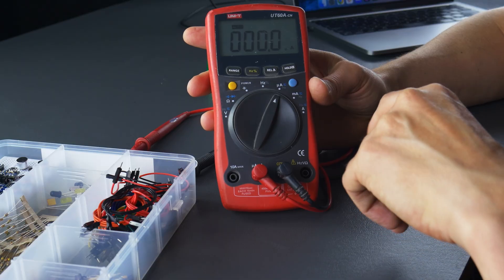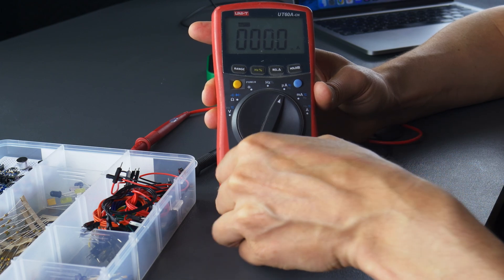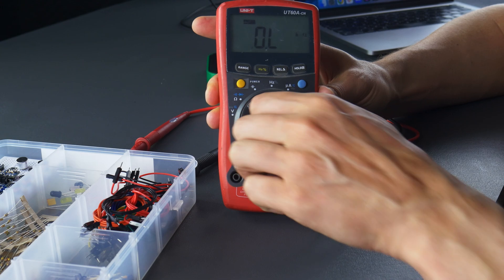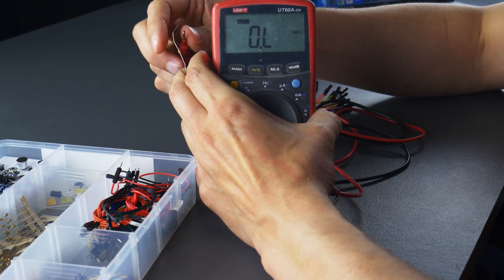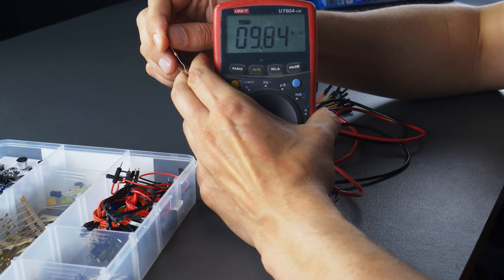I can just take a resistor out of it — I chose this one randomly. And the first thing we're going to do is measure the resistance. This is actually something where I can just use my typical multimeter. To measure this, first we need to make sure that our leads are in the right spot. Right now it's set up to measure current, so we want to make sure we're actually measuring resistance, which we can tell by the omega symbol right there. So we plug that in, then we've got our ground right there, and we change this over to measure resistance. We just touch across the leads — one on each side of the resistor — and it says 9.84 kilo ohms, which is 9,840 ohms. This is most likely a nominal 10,000 ohm resistor, so it's probably designed to be 10,000 ohms, but it's just a little bit off. You'll find that on almost all resistors they're going to be slightly off, and that's called a tolerance.